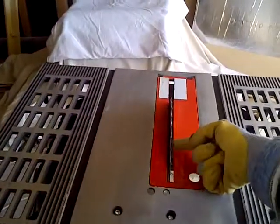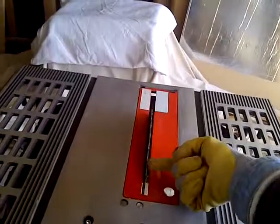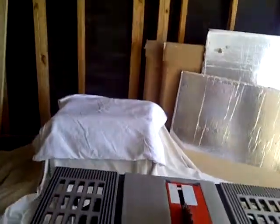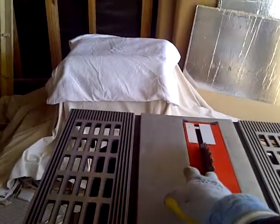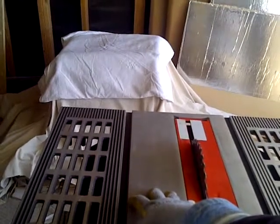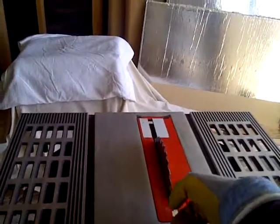Still worked for me. I usually worked on this side because I was aligning everything from this side of the blade. So basically, I matched up everything on this side of the blade when I was cutting, so everything I measured from this edge to this edge here. But on this one, I got more room here, so I squared the blade to this side of the table, and so I'm going to be working off from this edge, cutting from this edge most of the time.